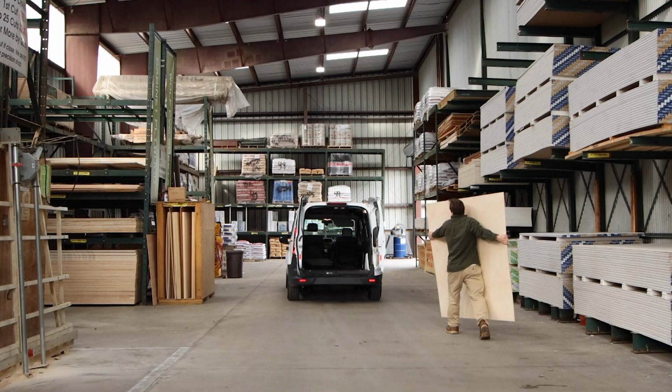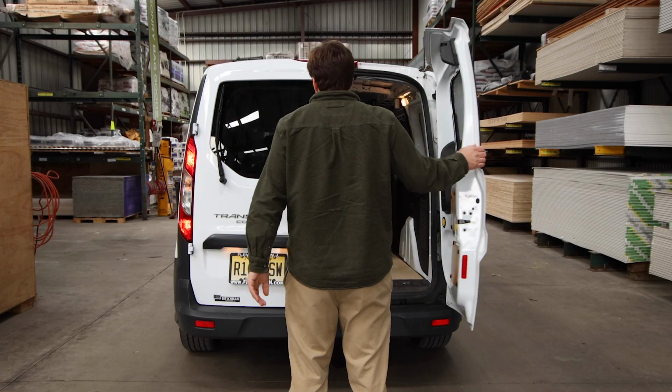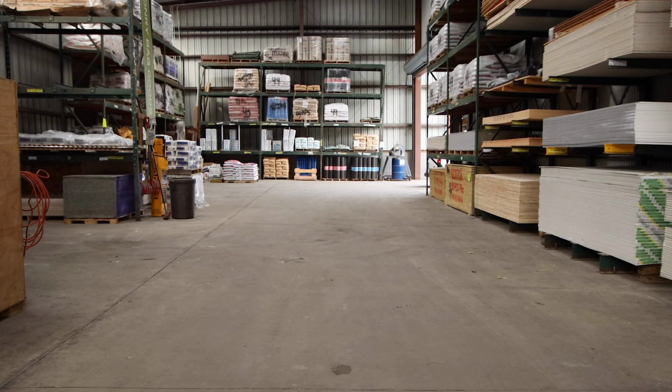So most of what I see being used in laser cutters is Baltic birch plywood. Baltic birch usually comes in 5x5 sheets and can be picked up in most local lumber yards, but you could also buy it online. Unlike proof grade plywood, Baltic birch doesn't come with any kind of protective masking. So you can apply protective masking to it, and I use this stuff all the time, or since we're just engraving wood, you can just sand it, spray it, and it looks fine.